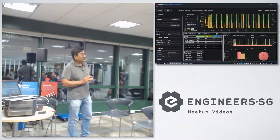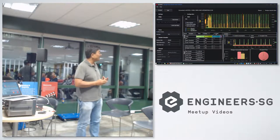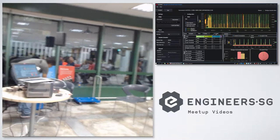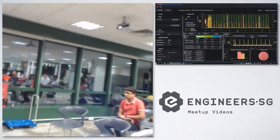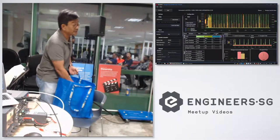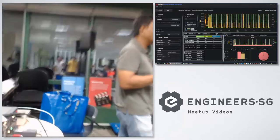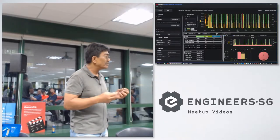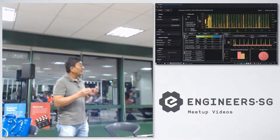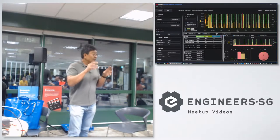A vendor came to me because I recounted to him how I did my power readings in the past. I relied on the old digital multimeter — a seven and a half digit multimeter that can read down to nano-amperes of current. However, all that reading was on static power consumption only. With an IoT gadget going into active mode, transmitting mode, then back to sleep mode, I cannot see when and how the power is consumed on average — I can only see it in short bursts.